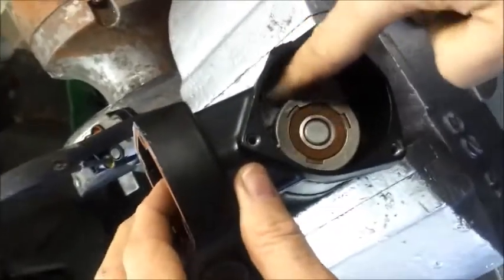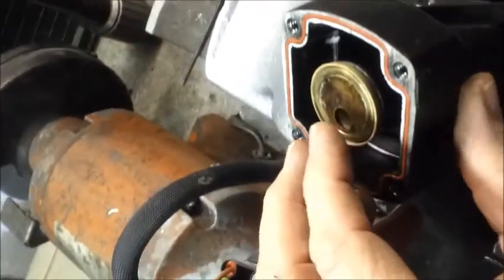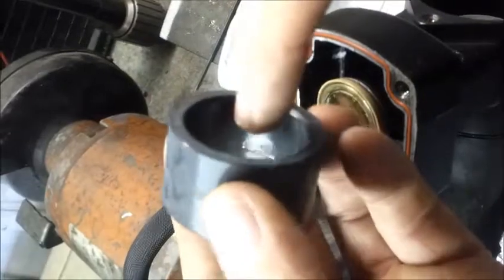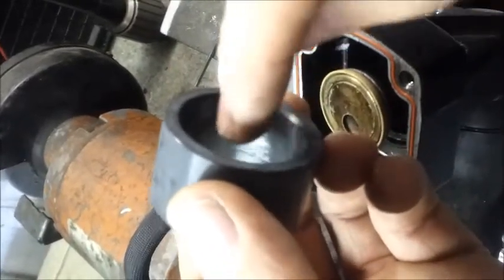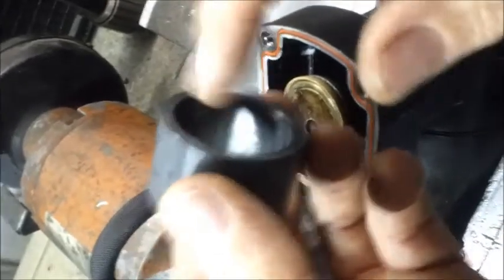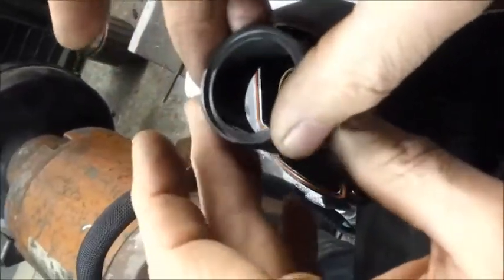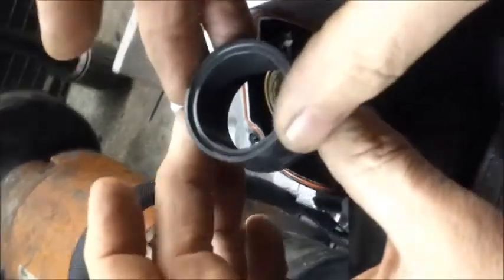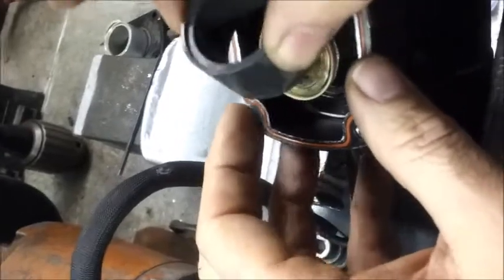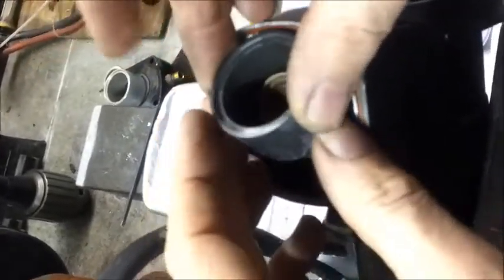You then get your piston liner and place a smear of dielectric silicone grease on the inside of the liner, only a very slight smear. This will allow the liner to be assembled more efficiently, and it will allow the new seal to bed in when you first switch the compressor on. So when fitting this liner, you position it at 45 degrees and then you rotate to the horizontal and then seat the liner in the housing.